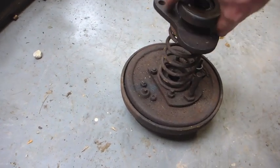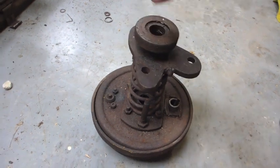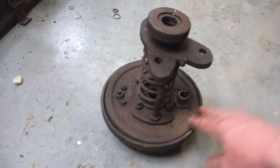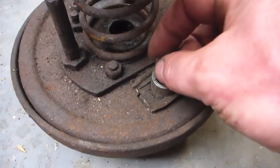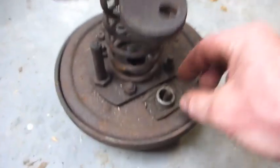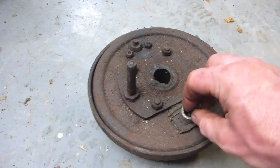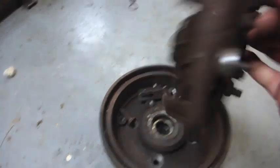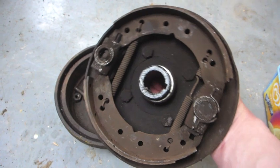So the clutch — because it's a mystery to lots of people — normally that spring is compressed. This peg here is a little guide to stop Mickey Mouse spinning around. On the end of this snapped-off bolt, there would normally be a rod coming up there, so the action of the spring being compressed is pulling on that rod — much the same way that when you pull on the brake rod it applies the brake. This is exactly the same: when you pull on the rod it applies the shoes, pulls them outwards.